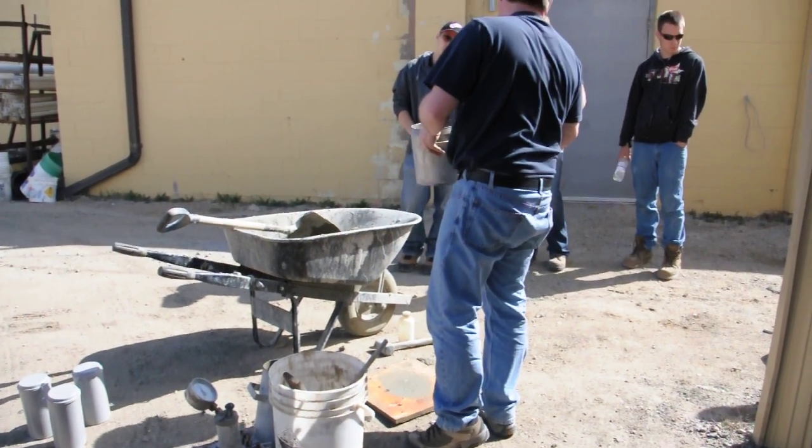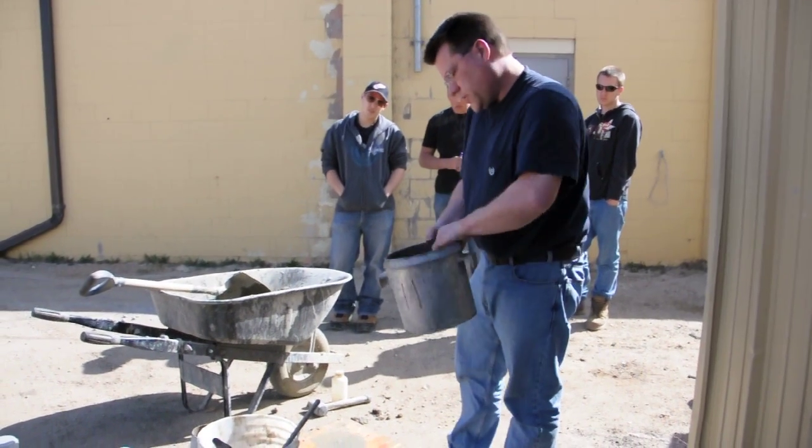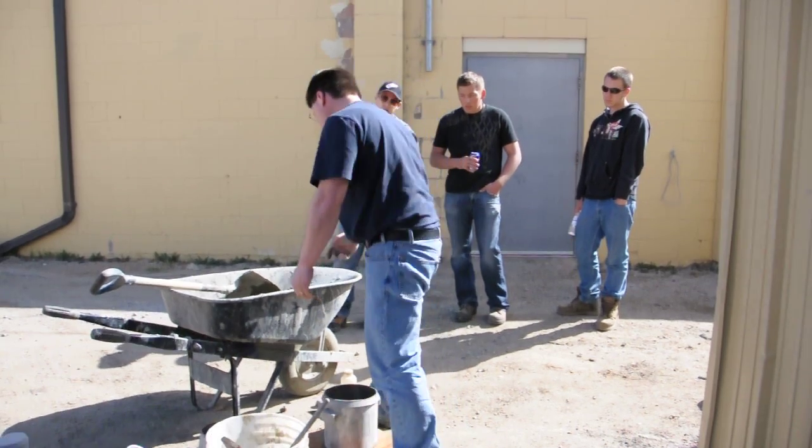You can re-use the concrete from the slump. That's why you always do the slump first, unless there's a specific reason to do the air first. You can re-use the slump concrete. You can't re-use the air concrete because we're adding water to the air concrete.